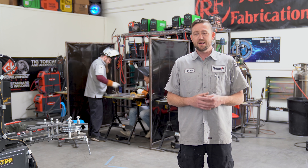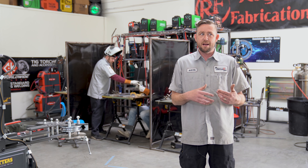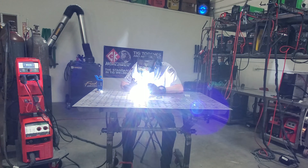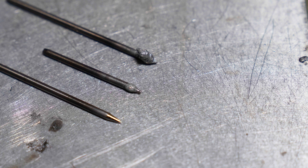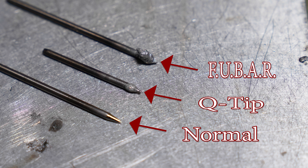Do a new control weld at the start of every single session. As soon as you finish making that weld, go up to your camera, stop it, wait a couple seconds, then hit record again. All you've got to do is keep on making welds one right after the other. Make sure you stop them after each one so that way you know where you're at. I'm going to run over a few different common problems and things that I see, and show you a few different ways you can use your phone to help you out.